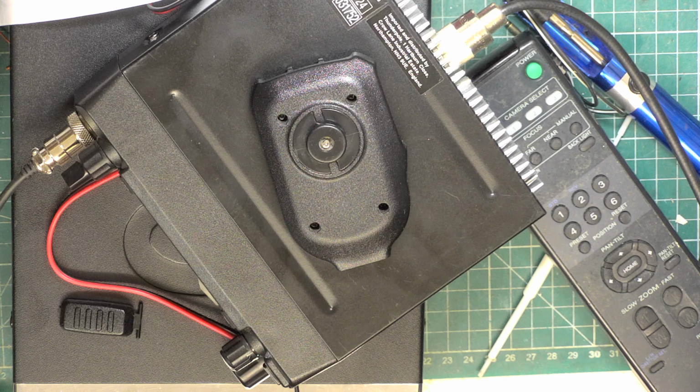And so when we did the on-the-air test, and we go through to the base station, you can't tell from the base station what the volume of the radio is, because it depends exactly how I've set the volume and how the AGC works on the camcorder. But when Mr. Chippie came back, he said, that radio is a bit quiet. And I thought, but the deviation is spot on. So in fact, it's a mic gain problem. But it's not the radio.